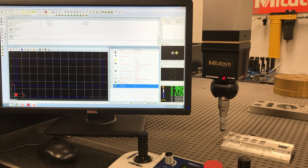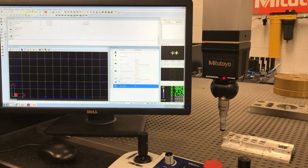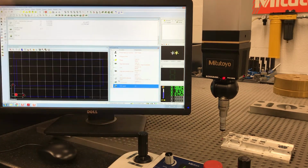Another thing, since I manually aligned it with my hands, and I know it's on L when I hit it, still I may be patty caking with it. I may not be hitting it consistently. It's always a good idea to go back and realign it in CNC mode, because the CNC is going to drive the hits at the designated speed, and you will have a more accurate alignment. Now it may only be 2/10, but 2/10 is more accurate.